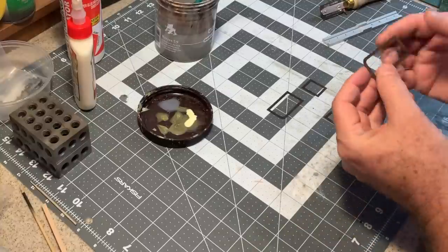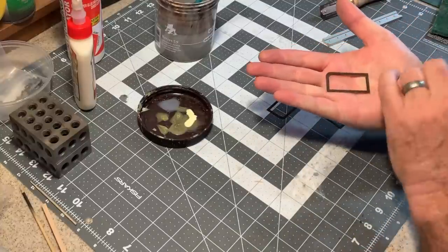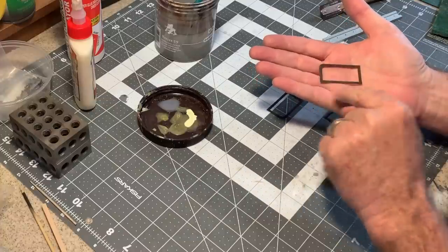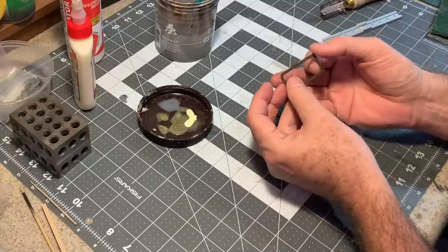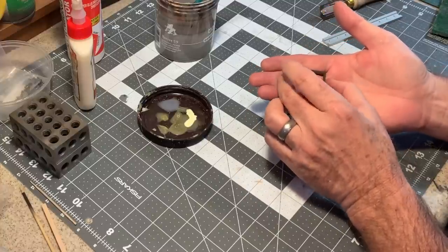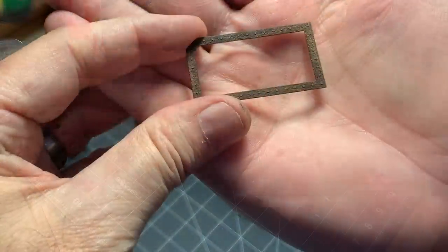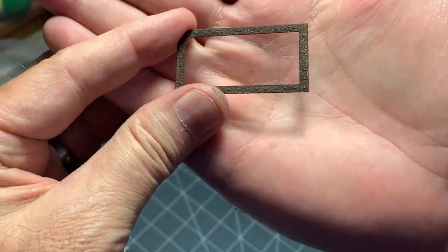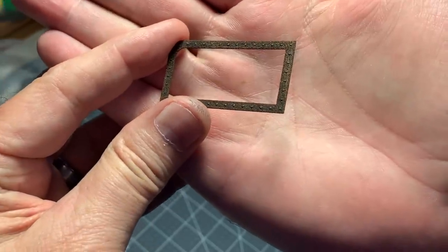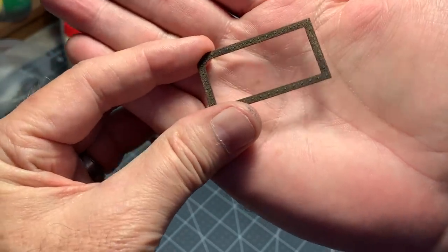These are basically iron strapping. The sides of the tender itself are going to be made of wood, but it's going to have this iron strapping around the outside. And I laser etched these with rivet detail. Let me give you a close up here so you can see. That's done just by etching away everything that is not the head of a rivet. So this is some 25 thou laser board that I used.